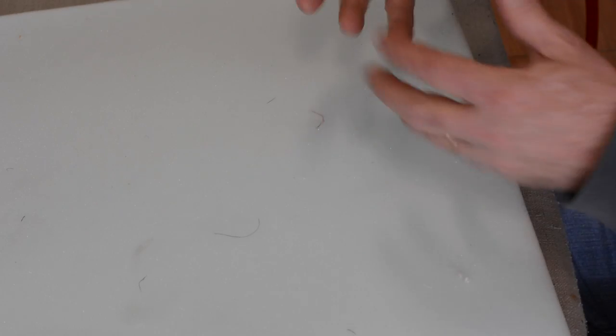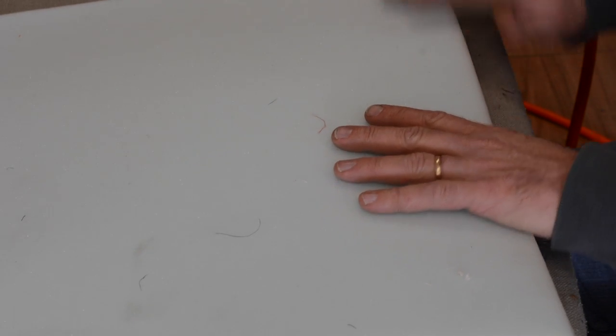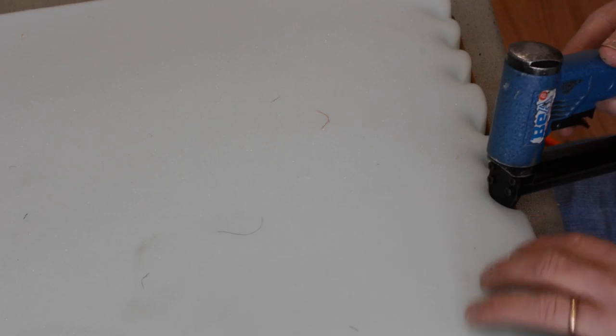And now I'm going to stay to the top of the frame because these sit inside the frame. You don't want to bring your padding over on a slip seat that sits within the frame. Be very careful. The only thing coming over the edge is going to be the fabric because it's already a very tight fit with nothing on it. Each slip seat is different, every slip seat's different the way it's done, so you have to really pay attention to that. On top, I'm right up at the top of where the wood has been beveled.